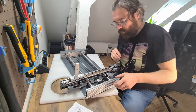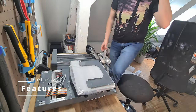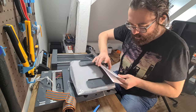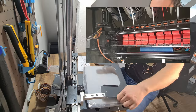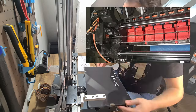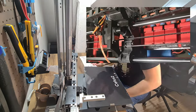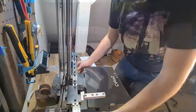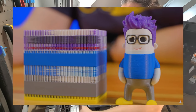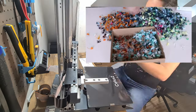While my past me is busy assembling the printer, let's discuss the key features that make this printer so special. In conventional multicolor printing, the filament change occurs at the point where the heatbreak begins. When changing color, the printer needs to perform a lot of retraction to prevent mixing half-melted filaments. To clear this, the printer typically extrudes the filament onto a purge tower to clear the nozzle. However, this often results in a purge tower that is as heavy as the printed model, leading to a significant waste of filament.